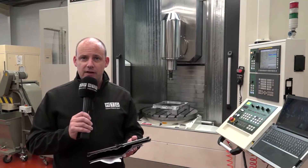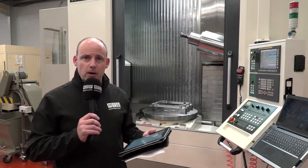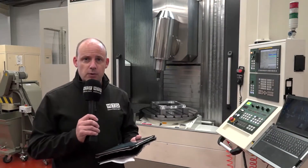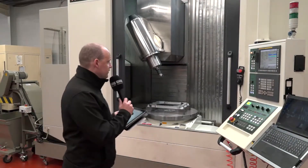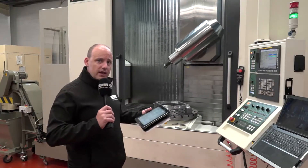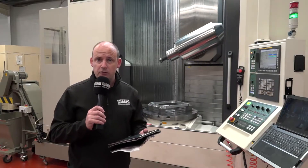The third model of the AX800 — so it is available in three models: this one, the AX800 II with a bigger working envelope, and the AX800 Aero 320. That's a machine that actually has two fourth-axis tables, one either side, with a trunnion-type configuration for structural parts machining.